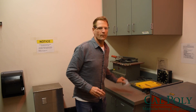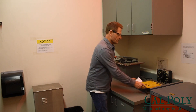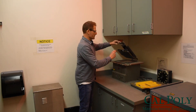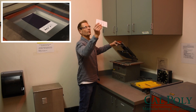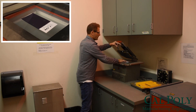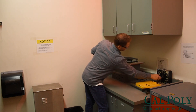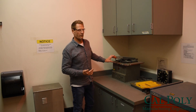First we're going to need a photo tool. The photo tool is the tool that we'll use to expose the copper. To do that, we'll start with a printout from a program such as DipTrace or Eagle — just a laser printed printout of our circuit design. Here I have four of them together. I'm going to come over to our light source and take some photographic film. I have a piece of photographic film and an intense light source, and I'll put the image of the circuit boards, which are printed on white paper which is somewhat translucent, down against the intense light source.